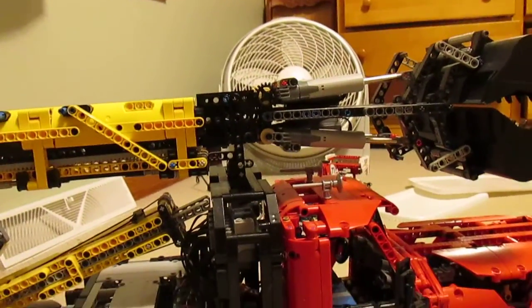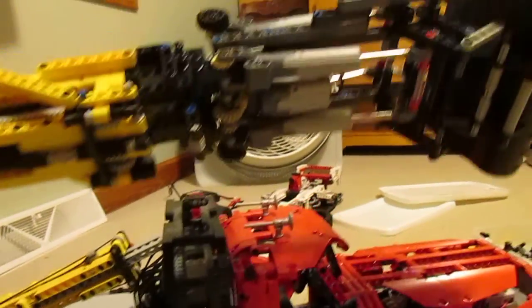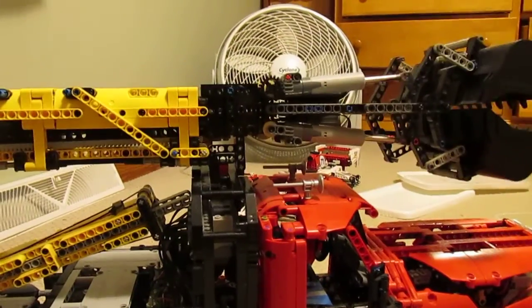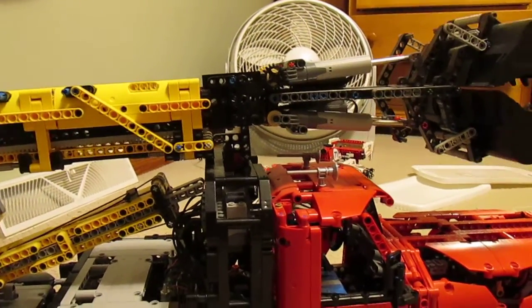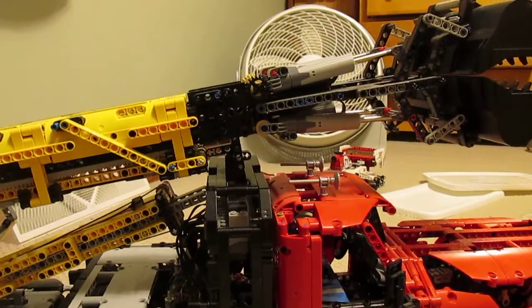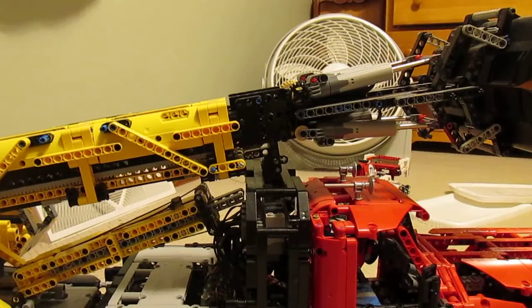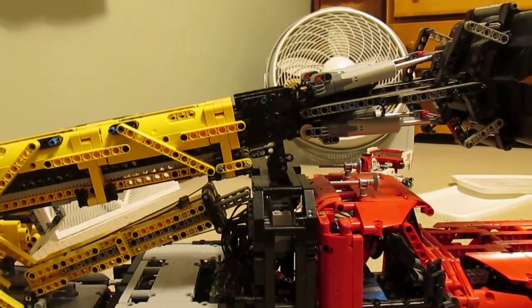This is how the whole crane will be when it's stowed. On the bottom here we have this hook, or this little finger, that engages with the tab on that outrigger arch. As it pulls back, it actually pushes a little catch backwards, which closes a switch, which allows me to operate the outriggers and transition the machine from digging to driving or driving to digging. That can only be done when the crane is stowed.